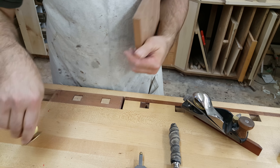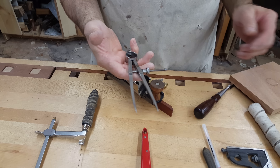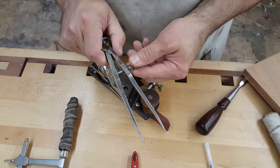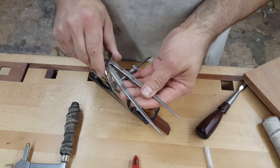The second thing is going to be paired dividers. This is for the layout. Six inch or three inch doesn't matter, but you want ones that will actually hold their fixed position as opposed to just relying on friction. They're spring loaded and the screw will change the setting and keep it fixed.